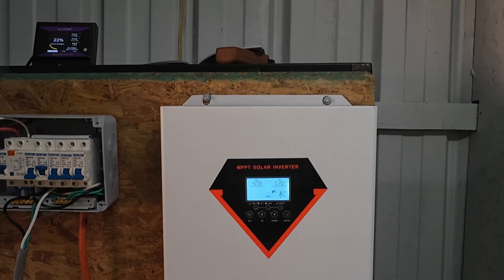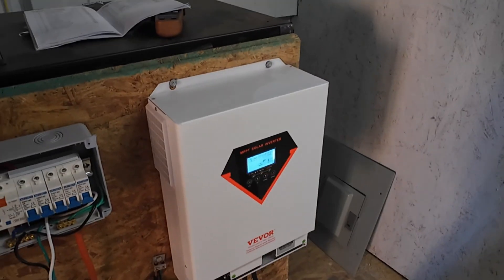0-4 at 50.8 volts. Turn the load off. There's no way it could be an overheating problem. It does require a manual reset though. The manual says it's PV module over-temp, but it turns out to be some kind of low battery error.